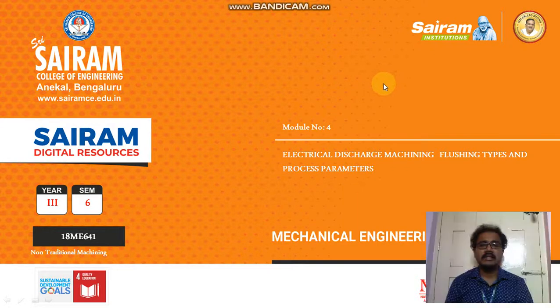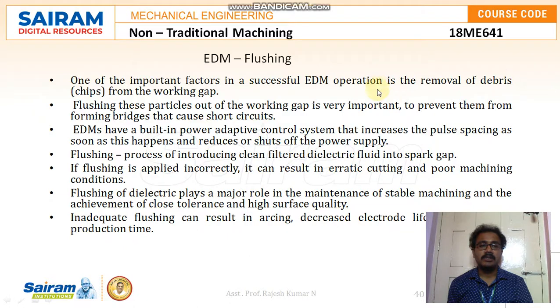Hello everyone. In this video, we will be discussing the electric discharge machining process, flushing types and its process parameters. One of the important factors in a successful electrical discharge machining operation is the removal of debris, which is also called chips, from the working gap.